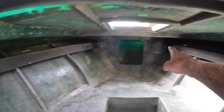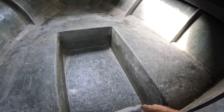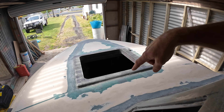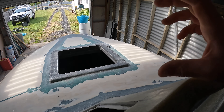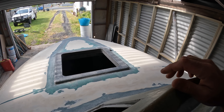I've also got our side pockets in the cabin here done. We've cut a hole for our hatch up forward and we have glassed in a floor section in there. Moving forward, I've made my hatch recess for the front there, squared that all up and laminated three pieces of thermalite to get the height required, and then we've cut a hole — that's where we'll drop our marine hatch in.